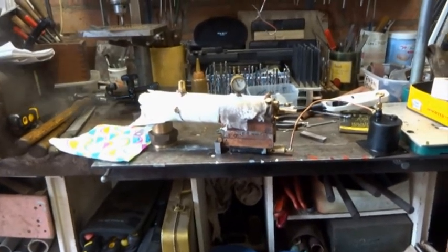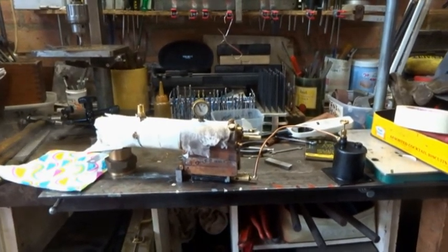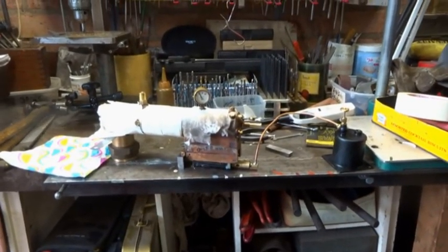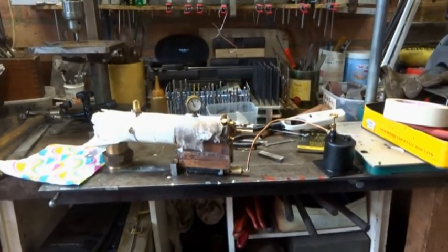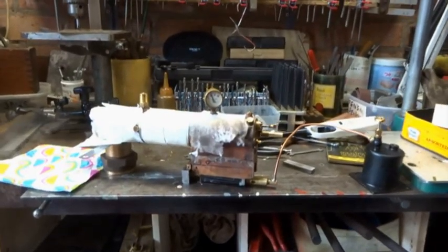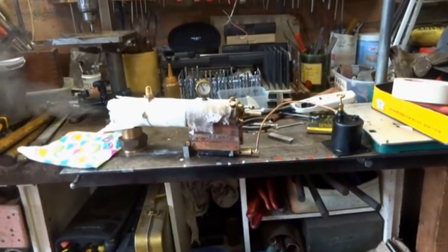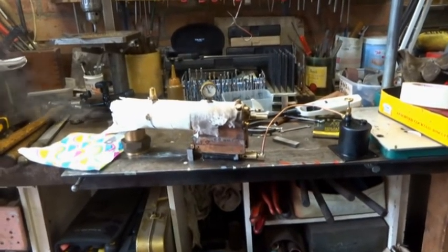Suddenly I'm beginning to feel a little bit happier. I was about to give up on ceramic burners altogether. But as usual, it turns out to be operator error or the ignorance of one Mr. Ed White. Pressure's continuing to climb. It's now gone comfortably over 40 psi. So if I had a properly proportioned boiler, no doubt in the loco, it would be fine.